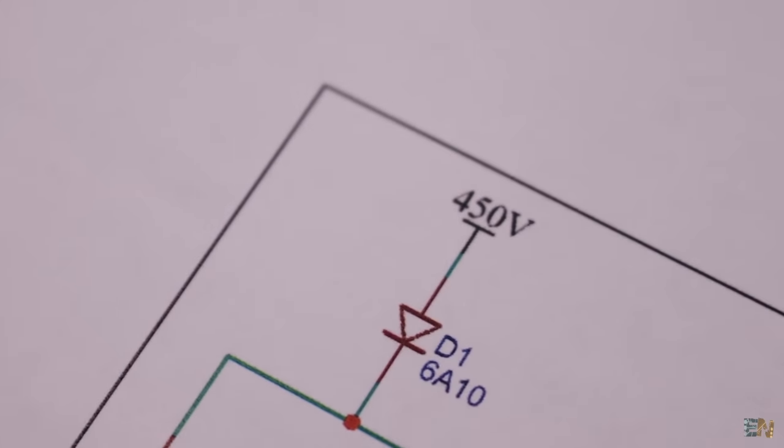Capacitors can charge with high voltage very fast and discharge almost instantly, without damaging themselves, so this will be a way better solution than using batteries. So that's why we get the power from the battery first, we increase the voltage and we store the charge inside of the capacitors. And then we release it all at once into the coil, creating a very powerful magnetic field.